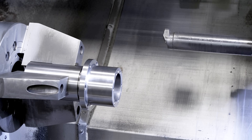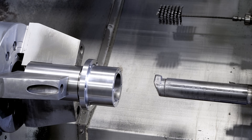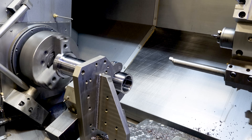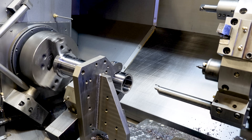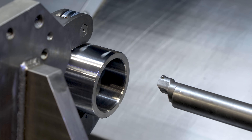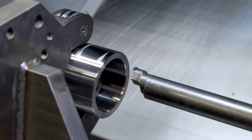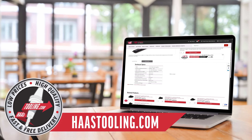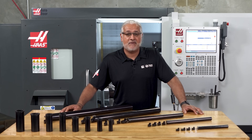The bars are being used to machine critical features on our spindle housings and other spindle bores throughout our facility. Note that these bars are pre-tuned to dampen vibrational frequencies and have a minimum length requirement for the dampening to function effectively — check the technical details page for each boring bar for that info and many other key points. If you're new to deep hole boring or already have this type of tooling, I hope this video helped. Check out the performance and pricing of all our tools — we think you'll find they compare very favorably with other top brands. My name is Bop Singh, thank you for watching.